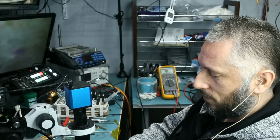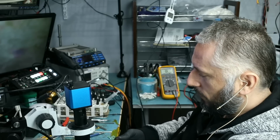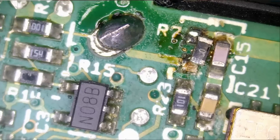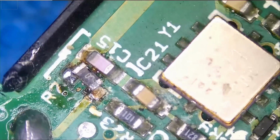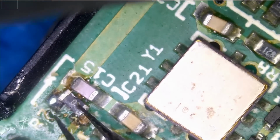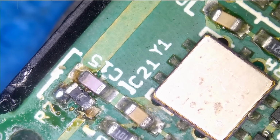Like I said, the customer cannot use the car without those fobs, and both of them are not working. Fob number 1 was a quick fix, and hopefully we can do the same for fob number 2. I do not want to expose the board to heat, so maybe we can fix this 0 ohm resistor using a soldering iron.